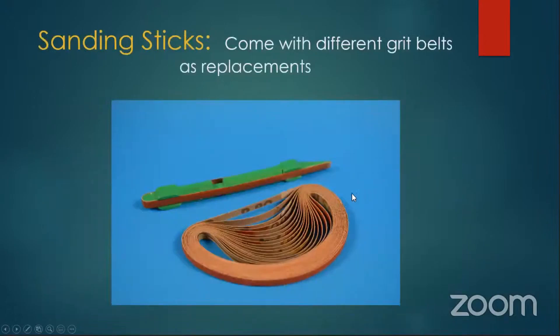Sanding sticks — everybody's probably familiar with these. You push down on their spring-loaded mechanism and you can move the belt around. When you're finished, you can have multiple different little belts. You can see here these are 80 grit, there's 100 grit — so you can get different grits for different work. These are fantastic for doing windows and stuff. A little tip: take those little clothes pegs and break one apart. When you've worn most of the sanding belt, there'll usually be two or three spots not yet touched. Cut that little piece, use some contact cement, glue it onto the end of the wooden peg, and you can use that as a mini filing piece for little pieces.